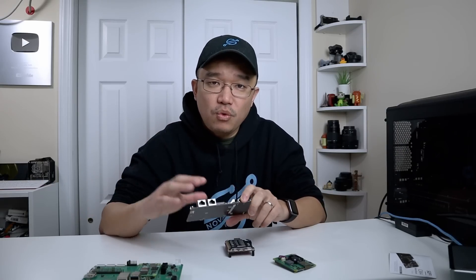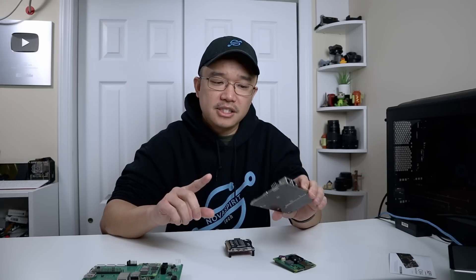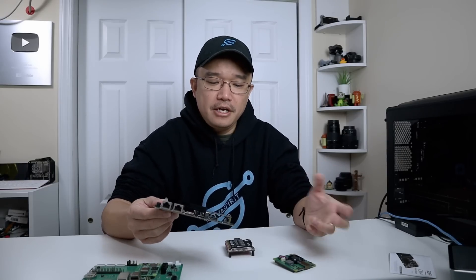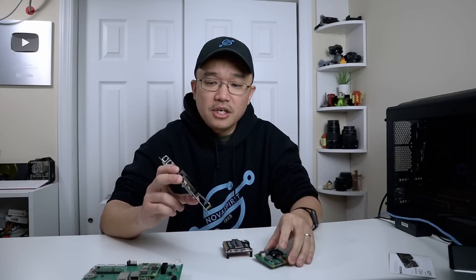On the underside of the board there is absolutely nothing. They took the PCIe adapter and turned it into a NIC. Compared to the Seed Studio version, which had a USB 3 card and a USB 3 NIC, you lose USB 3 on this board. That's primarily the difference between the two, but you do gain the 40-pin GPIO — so if you want to use GPIO for switching things, connect a Pi Juice, or use a PoE adapter, you can, which is something the Seed Studio version cannot do.